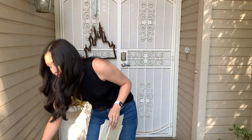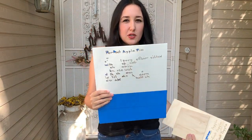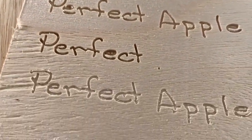I'd be lying if I didn't mention the hiccups along the way — I had to start the project over. I originally intended to use quarter-inch plywood, which is super light, but I just didn't love the carve I was getting when I ran the V-carve on it. I ran so many tests at various step depths — V-carves and advanced V-carves — and got a lot of tearout. This is exactly why it's so important to run tests. Ultimately it taught me a lot and I feel more confident using my machine going forward. If you mess up in the middle, just keep going, power through, and take note of the lessons for future designs.